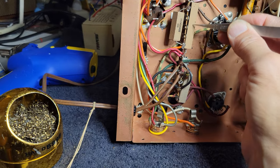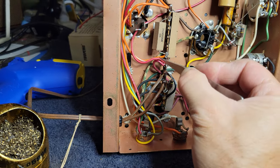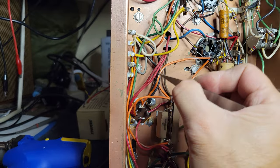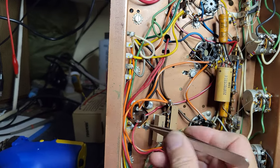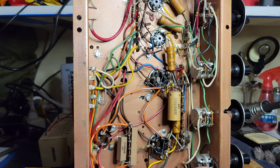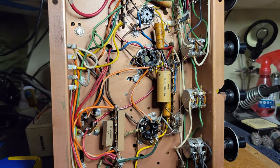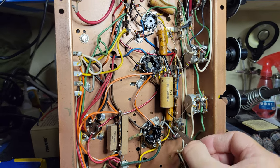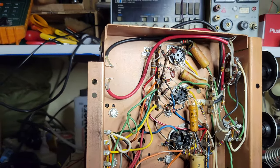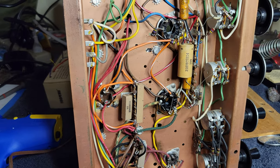Here we've got the rectifier, the secondary coming into the rectifier, and the high voltage coming off. It drops through this resistor — about 220 ohms — then goes to a capacitor, resistor, capacitor. And then that's the plate voltage. Here are the lines going to the output transformers. We can see the filament supplies. This is done quite sloppily. The only pair that's mildly twisted is this pair going to the rectifier. The rest are just forming big old loops all over the place, which is just going to be radiating all sorts of AC at 60 hertz. Those need to be twisted, even if I keep it in relatively stock circuit configuration.